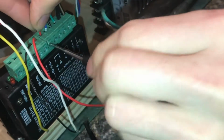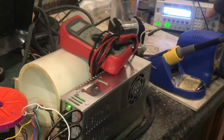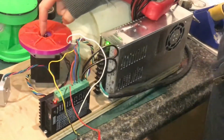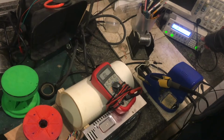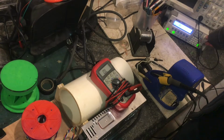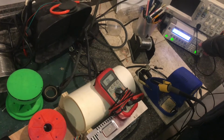Okay, well, I just finished wiring up this stepper motor in the standard way, using the whole coil. And I'll give it some juice. I'm going to start this off kind of slow at 1,000 steps per second. So there it goes. There, that's a little bit better on camera. Let's increase the speed by 0.1 kilohertz. So there's about 2 kilohertz. And so it stopped at 2.3.